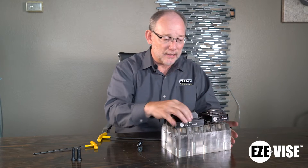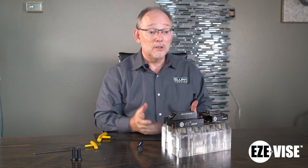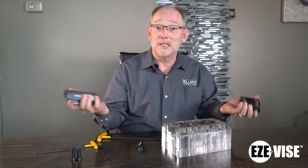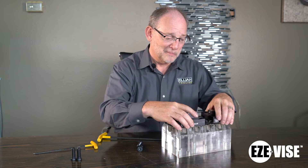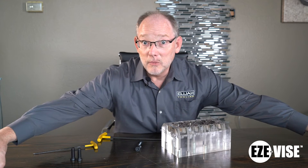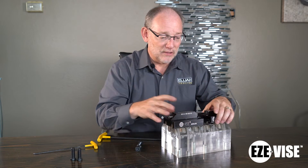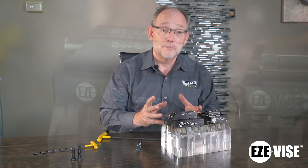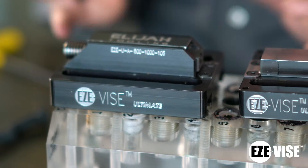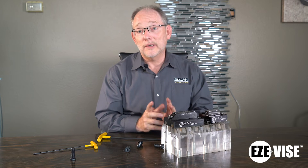The great thing about these — look, not very heavy but very robust. So you don't have to load a big, massive vise onto your fixture plate. These go on rapidly, they go on repeatedly, and even more importantly you can separate them by whatever distance you want. These products bring a lot of value because they're very flexible. And like I said, you can use them from a legacy standpoint — if you don't have the Invertibolt system, it doesn't matter, because you can use them with screws and regular dowel pins. Anyway, we're going to go out to the machine.